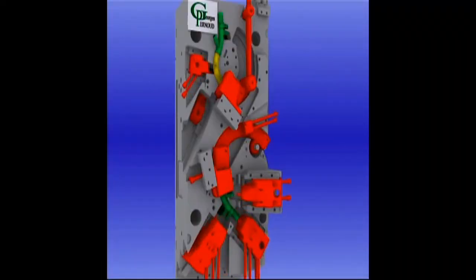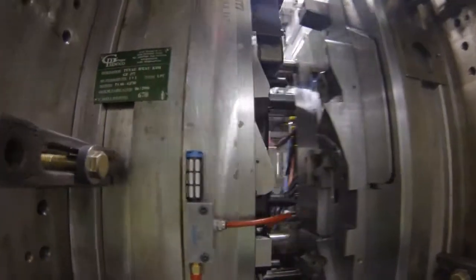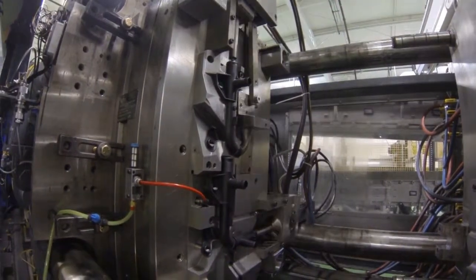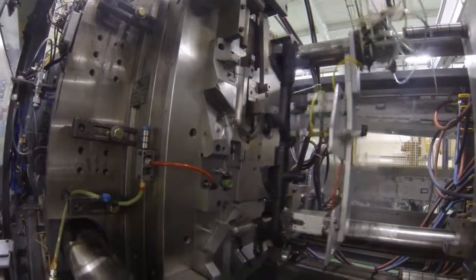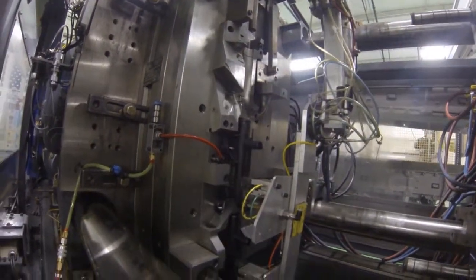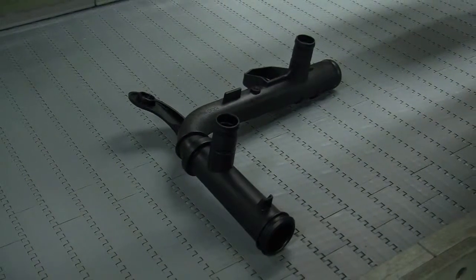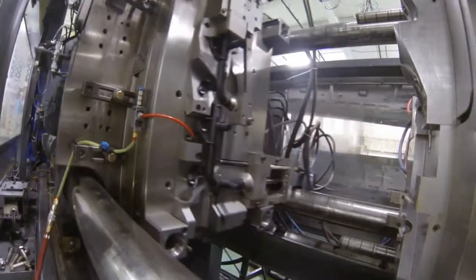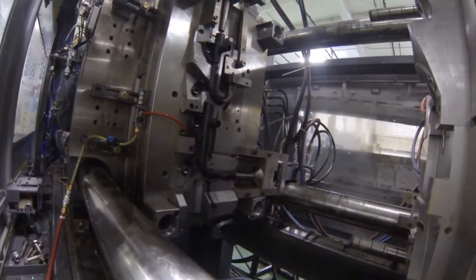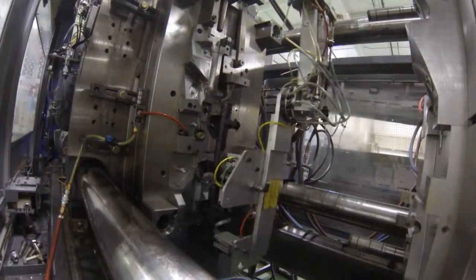Multi-tube technology is a patented technology developed by our European partner, George Pernot, whereby essentially it's used to join multiple components. In any case where a customer would like to combine components, potentially they have them released as separate designs right now and they want to combine them, or they have a design of a part that requires it to be welded. Right now it's a two-piece molded part required to be welded. Multi-tube is designed to eliminate those secondary processes and combine it so that it comes out as a one-piece finished design right out of the mold.